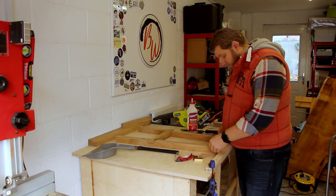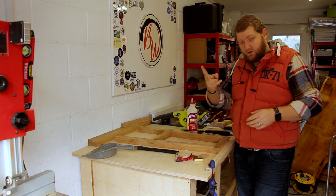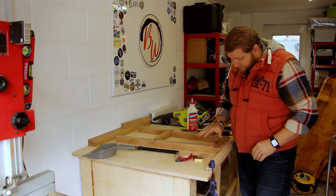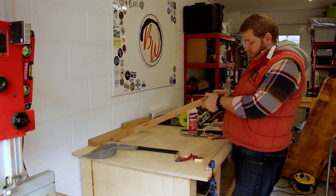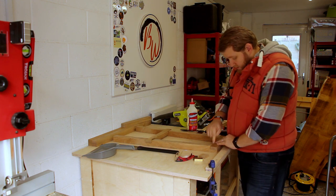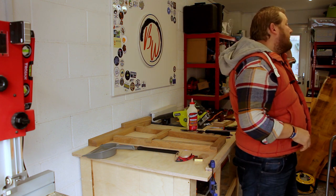So as you can see, I've got one side of the stool done, so I've only got three more to do because I'm also doing two stools. But these are my first ever half lap hardwood joints. That is pretty good, so I'm going to dowel these into place, glue and put a couple dowels in. I think I've got some hardwood dowel, if not I guess I'm going shopping.